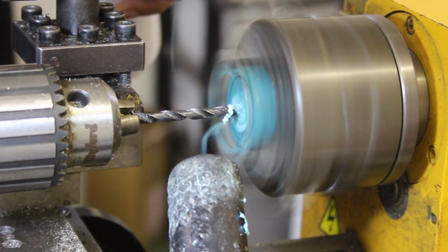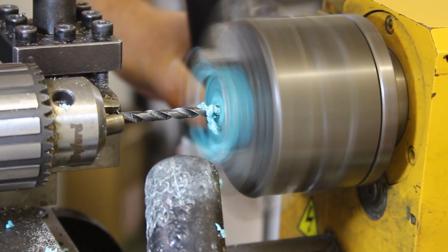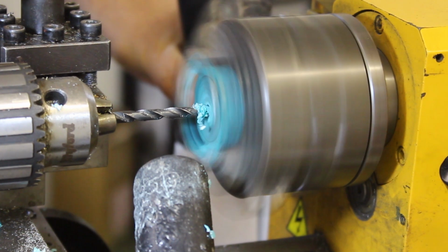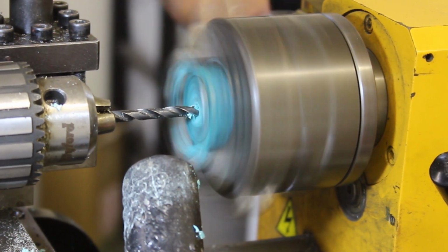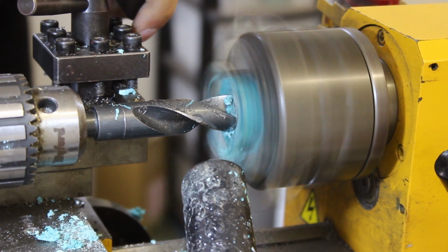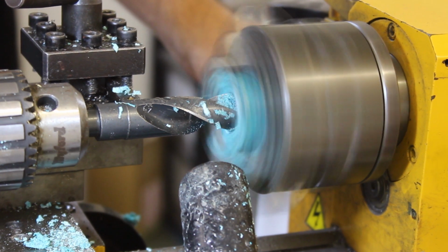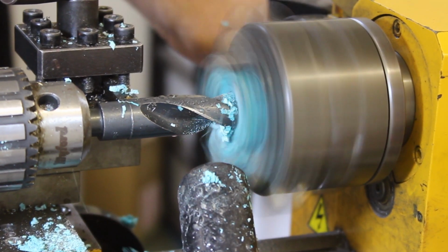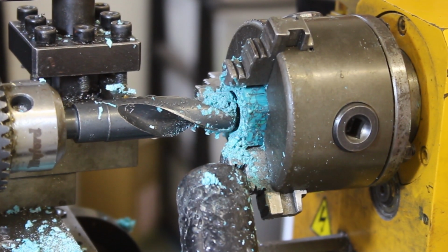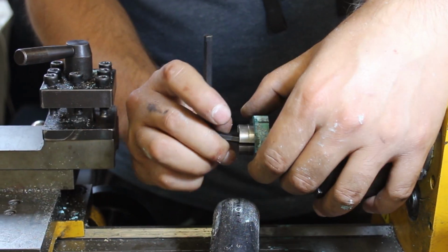Then I needed to make a hole for the ring, obviously, so I did that first of all with a few drill bits, and I just drilled it slowly. I step drilled it the same as I would with titanium or steel, and the reason I did that is just to avoid overheating. You don't want to get the Trustone too hot.